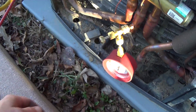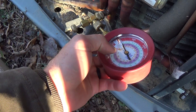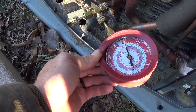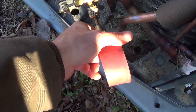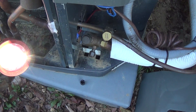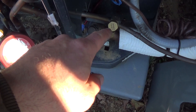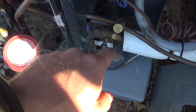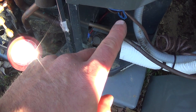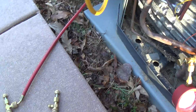I've got quite a few of these and really love them. I also have a couple sets of stubby gauges — you can actually buy new crystals for like four bucks a piece and boots for about ten bucks to rebuild them, which is awesome. I like using smart probes, but in the wintertime it's great to avoid frosting your fingers. Sometimes manufacturers put these valves in the stupidest locations and you can barely get a hose on them, so it's great for fighting in those tight areas without refrigerant freezing your hands at the same time.